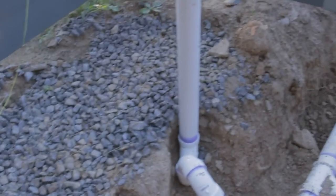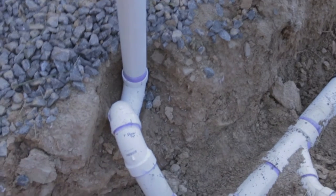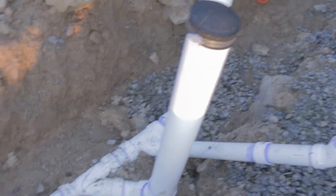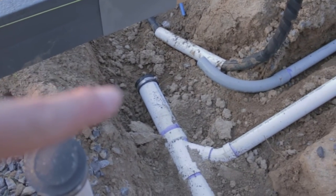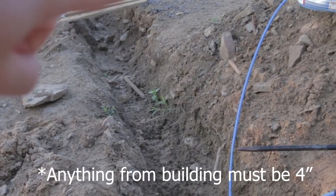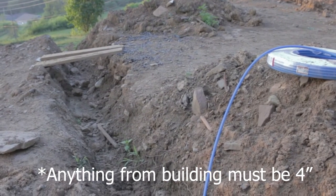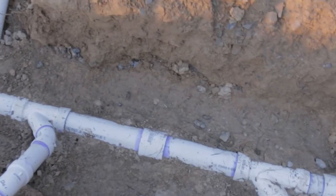All of these lines — the vent, the shower, the sink — must be two inch because it is under slab. That is the smallest they will allow for sizing. We just have three inch for our toilet and our main trunk. From here out, we can still do three inch. We have our main trunk line running from the house and we'll probably catch it somewhere down there and then switch into our four inch line. But three inch is good under here.